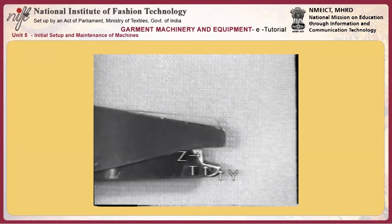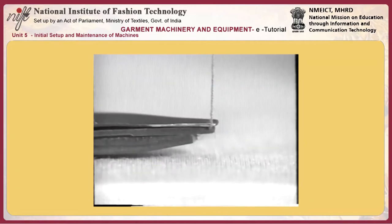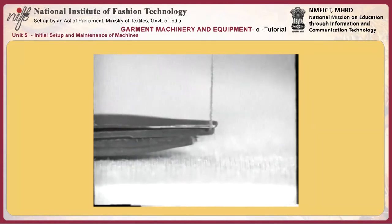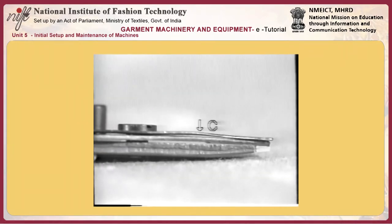19. Longitudinal and lateral position of the needle thread trimmer. The needle thread trimmer should be adjusted so that its portion H meets center of the needle A when the trimmer travels to the forward travel end. In addition, adjust the needle thread trimmer so that its stop end I protrudes from the center of the knife stop by 5 mm to the right.